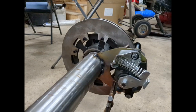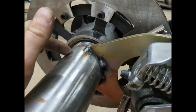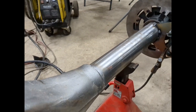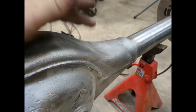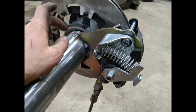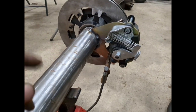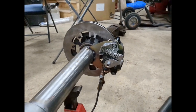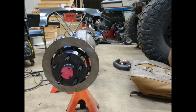We look nice and perpendicular from the axle here and I'm just going to finish burning it on. But right after I said that, I remembered that we have a rubber seal right here. The last thing we want to do is get the tube hot and damage our seal. Since the entire assembly is going to have to come back apart anyway after we get all the brackets on it — to either paint it or have it powder coated — that'll be the time to do the final finish weld from there. The easy part of putting the first one on is done; now the second part is replicating the same angle on the other side.